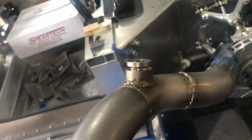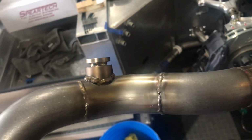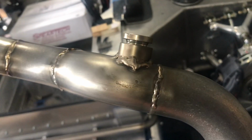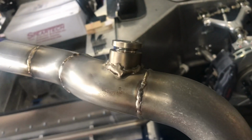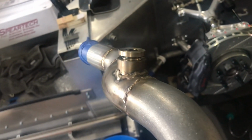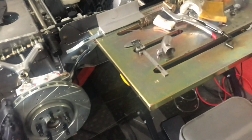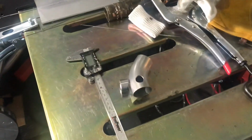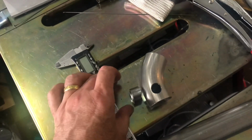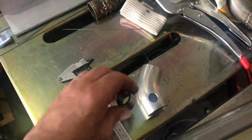And the weld looks totally sloppy and sort of crummy. B, I put that cap in as the bung was cooling, and I felt it tighten up, and it turned out it seized. So I can't even get that cap off. So I ordered a couple more elbows and a few more bungs, and I took a little more time fitting the bung onto the pipe.